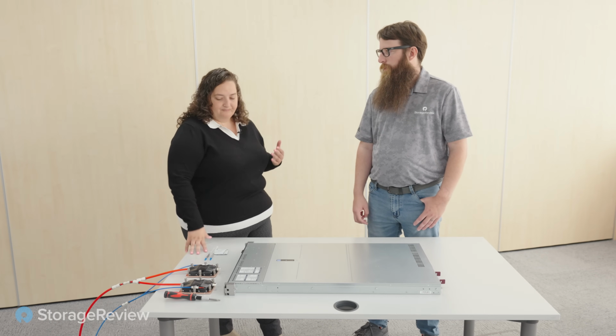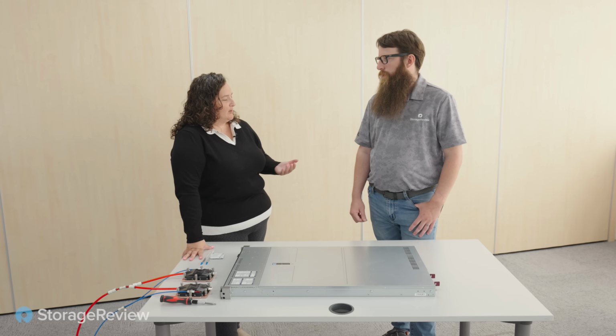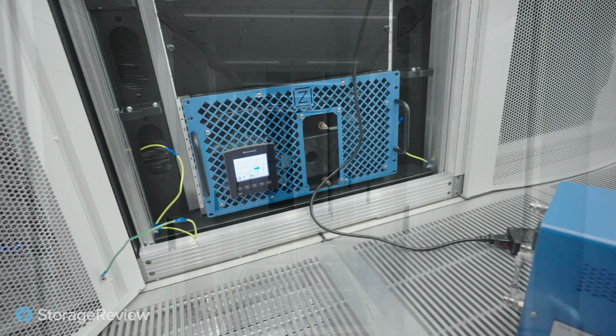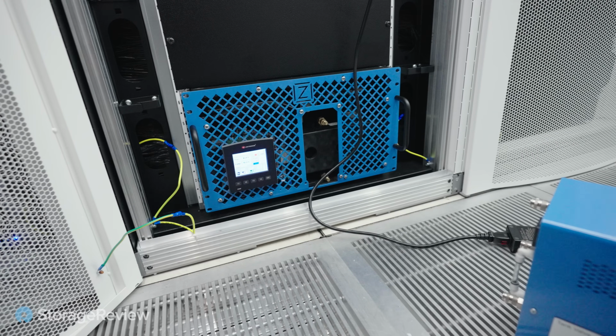And then from there, the primary loop, which is the loop that condenses the vapor back to liquid, can be either based on air or on water. For air, let's say for old data center infrastructure, where you have raised floor and stuff like that, it's really convenient because the HRU sits at the bottom and takes the cold air right from the floor.